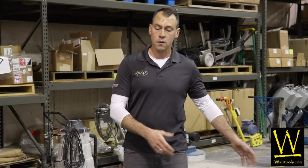So that means there's no open time, there's no open window. Epoxy has about a 24-hour open window where we do not have to re-abrade it unless you have bubbles, and we can get a chemical bond, interlayer adhesion, between the two coats. On urethane, that's not the case. We'd have to regrind this. But again, for our purposes today, we really just want to make sure that we don't have any telegraphing issues with the next layer we put on.